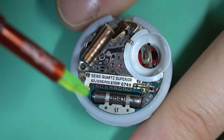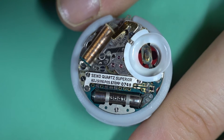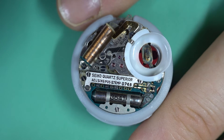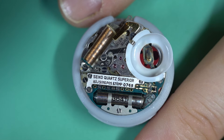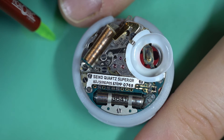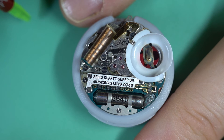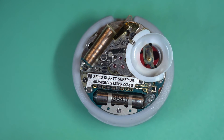Another advantage is that you don't have a single capacitor that can die, which is quite often what happens on these early quartz movements. If anyone working on one of these is really stumped, leave something in the comments and I'll get to it, or email me for further tips. This is one of the GFA or Quartz Superior 3883 movements, designed to be extremely high accuracy — all the magic is right there. Thanks for watching and I'll be back again soon.